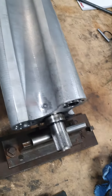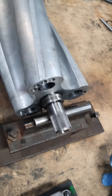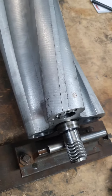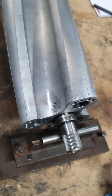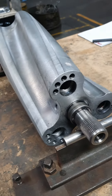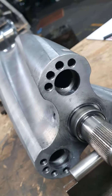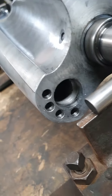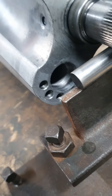It'll just sit there and rock backwards and forwards until it finds the heavy spot. What I've done is take a little bit of metal off the bottom of it there - I've left the well plugs out the bottom - and on the inside of it there, there's enough meat around the shoulder for the plug.